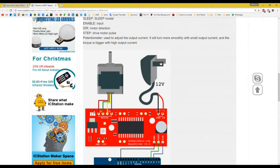This is how you connect your stepper motor — whether you have a big one or a small one, the connections are more or less the same. If you are not sure which two wires belong together, put your multimeter in continuity mode and touch two leads together — for example yellow and blue. If you hear a beep, those two leads are on the same coil, so you connect those two together, and the other two leads go to the other coil input.